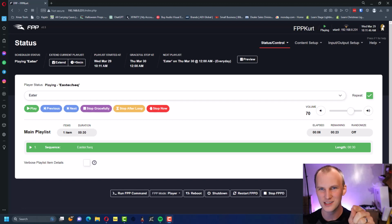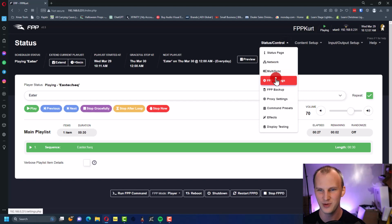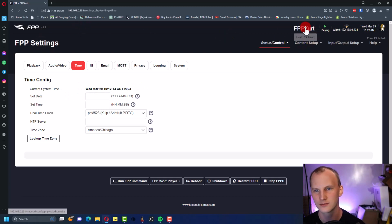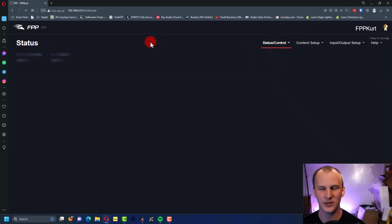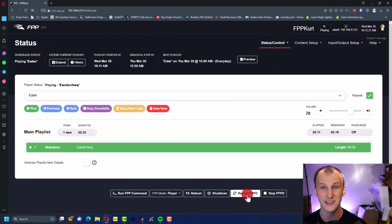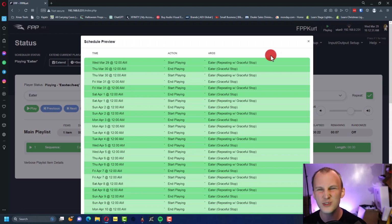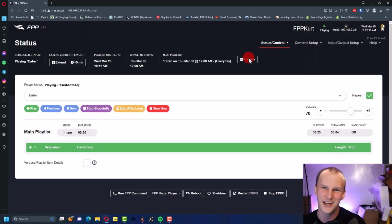Okay, so I see the problem with my schedule here, guys, after I finish the video. It's that my date and time on this controller was way off because I'd never set up the time because I'd been using it in my show as a remote instead of a player. It had no need for time, but now it does. So when I did set the time, which is, at least in this version of FPP, status and control, FPP settings, time, I set the time correct, and then lo and behold, I go back to the status page, and if you reboot, restart the FPPD, or just restart the whole controller, then it picks up on the schedule automatically. Then I can hit preview and see my future schedules. It should have shown me my future schedules anyways, but it clearly didn't, and that's okay.